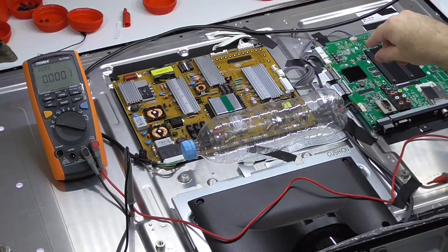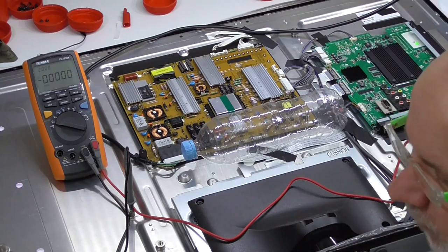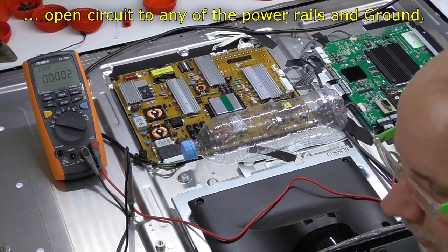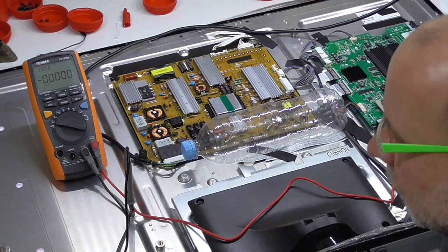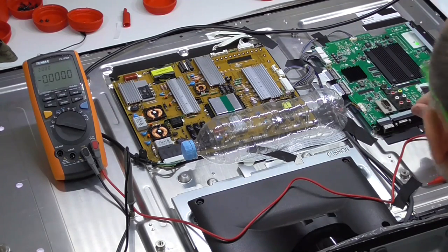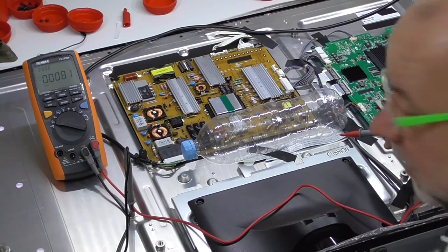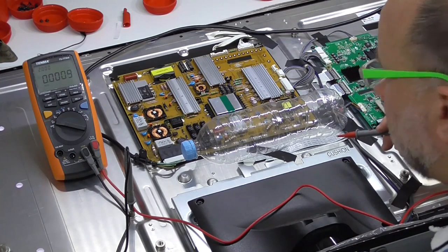I could see all of the optional circuitry was not installed. I couldn't follow on the PCB whether the trace was being used, so I used my 2 gigaohm range on my meter to measure it. Sure enough it was just a completely open circuit. I even tried using my LCR meter and it measured something like 30 picofarads, which is pretty much what you'd get just from the leads. The 2 gigaohm range was the clincher that it was open circuit. So the first thing I went for was the power supply because the most obvious thing was that the backlight wasn't on.